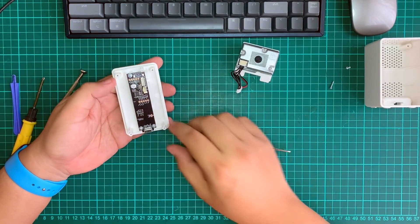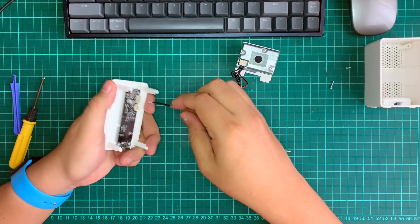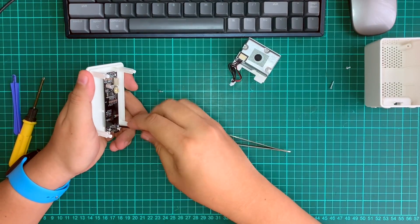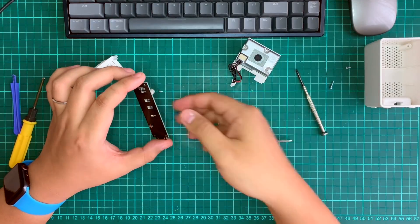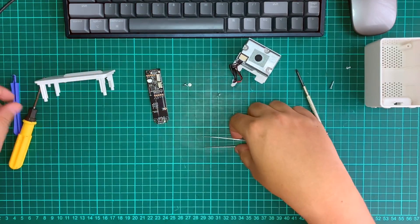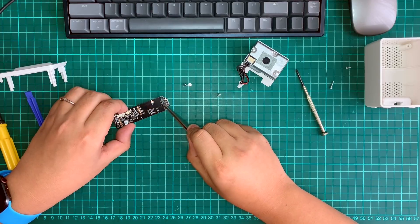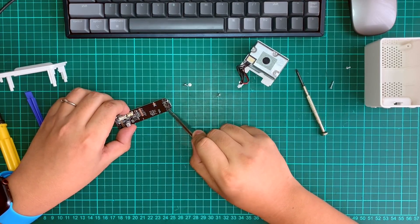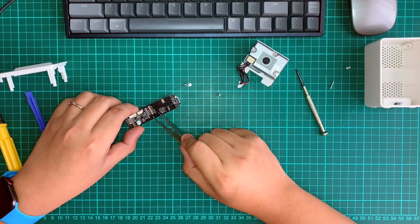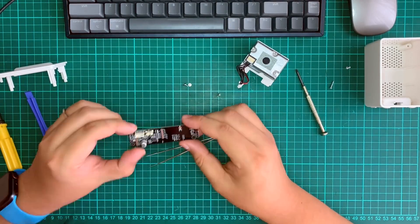Let's take a look at the board itself — it has three screws. The board has a USB-C power supply input. I think there is an ESD protection chip and some resistors to limit the inrush current. This is consistent with the 100mA draw, and then the power comes back for the rest of the circuit.